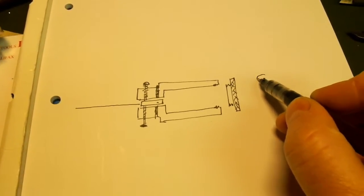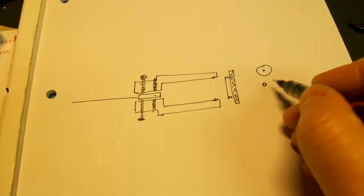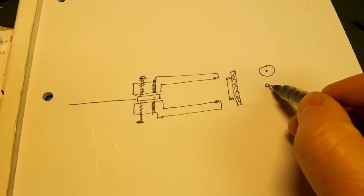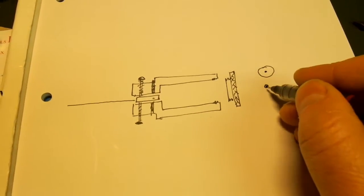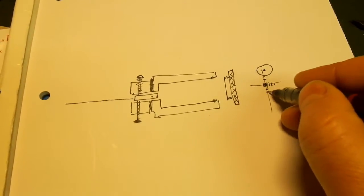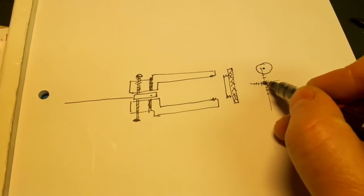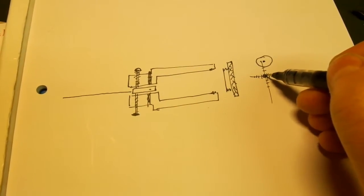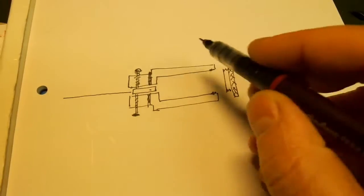I mean, at about 60 yards, you can get the dot within a circle of about that sort of size. It's limited by the binoculars I was using. I should have used a telescope, I suppose, and might have been able to see it clearly. But you could see the dot moving over, a slight amount, and I put graduation lines on there. I had a sort of target like that with graduations, which I printed out on a piece of paper with the graduations in white, so I could see where the dot was moving. And I basically just collimated that, rotating it the whole time so that the dot was absolutely perfectly still. And at that point, I knew that this is absolutely perfectly centered in every way.